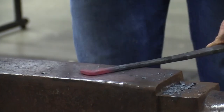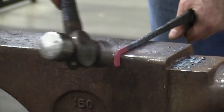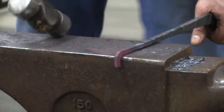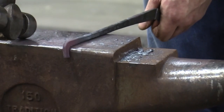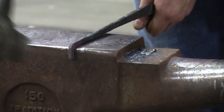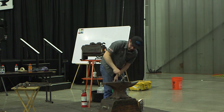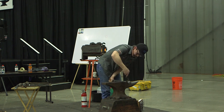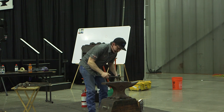It's okay to be creative in how you swing. You see a lot of people dig at this end because they never want to let that thing go past them. It's pretty hard, unless you get over the top of the anvil and come around, or you let that hammer handle pass your arm. So you gotta get your thumb out of the way and let your hand roll over so it can come back around to itself. You're now in a hinge. If you're trying to stay tight and lift over, your elbow and your shoulder are probably gonna start hurting. But if you can be a little loose and let the hammer carry around, it can get a lot of work done.